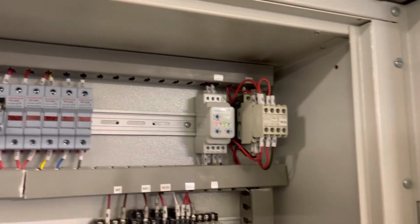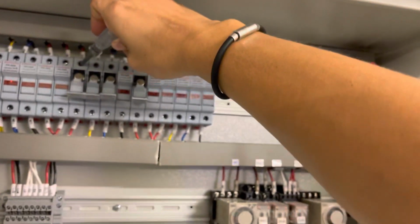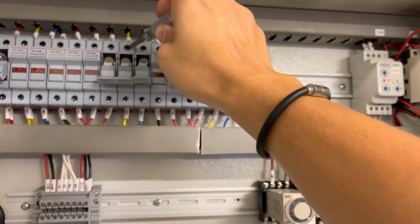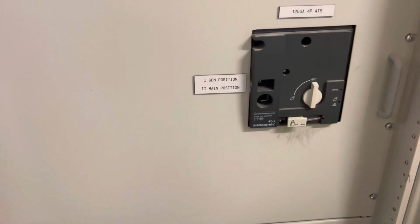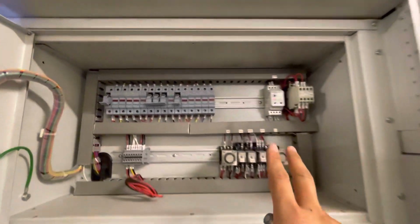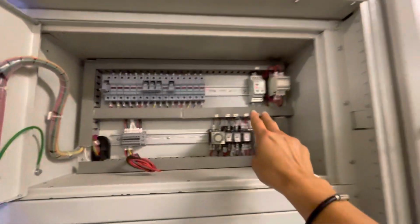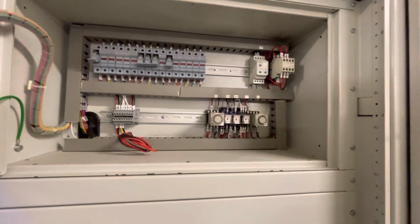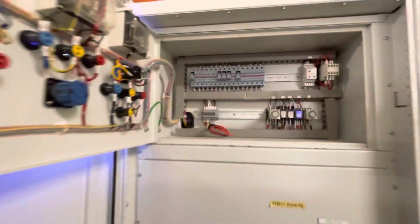Okay, we operate. So we wait for the genset to run. As genset runs, we will witness power supply arriving here at the genset fuse incomer. But ATS won't operate. This is because I opened the fuse here. Using this way, I can call the genset to run without causing any power interruption. And also I simulate during the TMB power interruption, the signal from here calls the genset to run automatically and remotely from this room, without going into the genset room to put manual or test on the selector switch. Now genset is running.